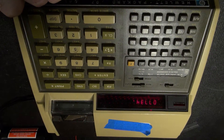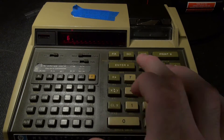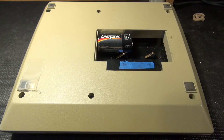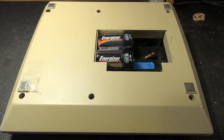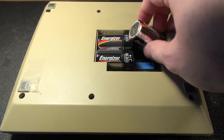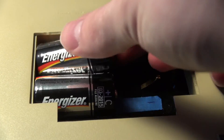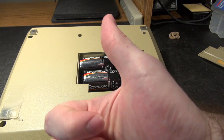Pretty good. I'm going to go ahead and say that this works fairly well. I don't know what else to say for this calculator. I've technically shown that you could, if you were daring enough, replace the batteries with C cells, but they physically cannot fit in there — there's not enough room. They have to be sub-C cells; there's really no other way to replace it besides that. Or you can go ahead and run it off of a bench supply at under 5 volts. We'll try it at 5 volts maybe at a later date, but at the moment the calculator is restored and functional.